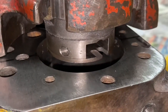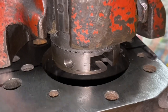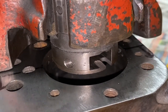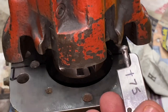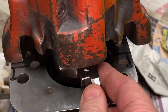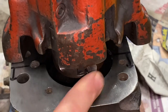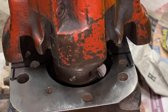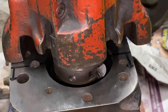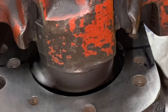That's the cutting head on the 944, and the receptacle there is where the cutting cartridge goes in. We'll put in the plus 75 size, tighten that up, and then we can start cutting. First up, plus 75 — push that right in to the stop, screwdriver in, tighten it up, bring that down to the start position, then connect the power, start the machine, engage the feed, and away we go.